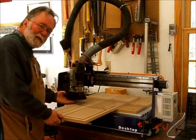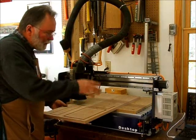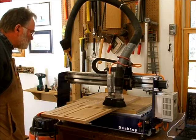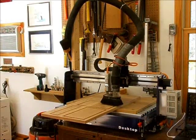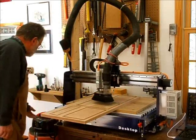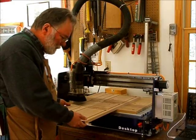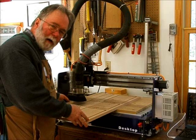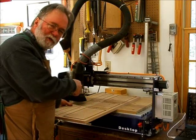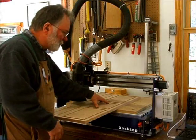I've shifted my wood — I did not have to reset the Z zero or the XY zero because it's the same piece of wood — screwed it all down, got my new file in, tile number two, and we're ready to go. By using the computer-aided design model along with VCarve Pro's tiling function, I was able to do what would normally be a very difficult operation — making all these cut-outs and making them exact.